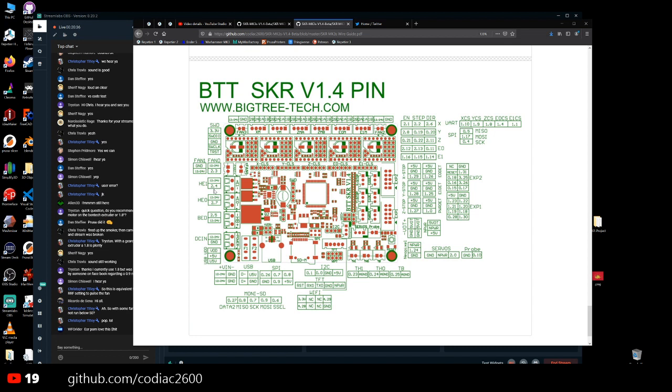So in our instance, it's pin 2.04 that we're going to use. It's just easier. But if you want to split it, you can. If we look at E1, we would use pin 1.25 if we were going to do that split. And you could do that anywhere. If you wanted to, you could wire fan 3 and do the same thing. If you have multiple fans that turn on and off when you need them, it's just no fun.